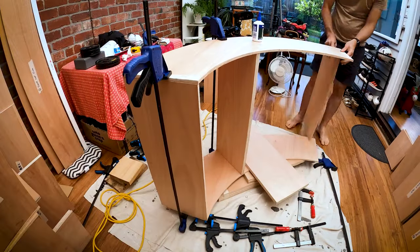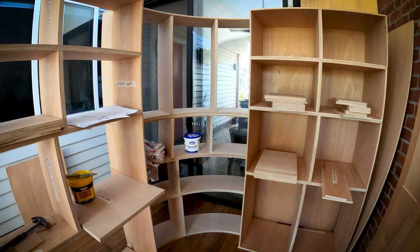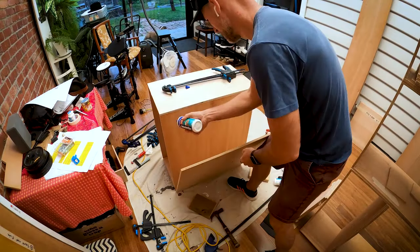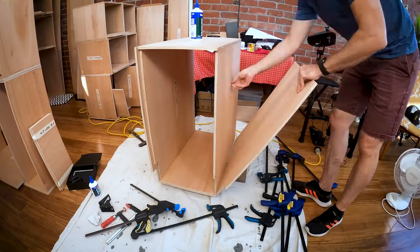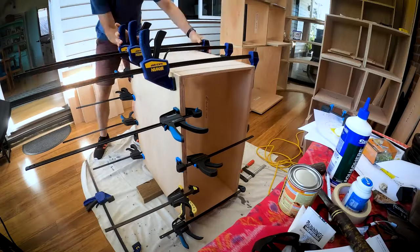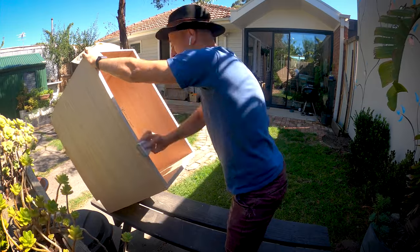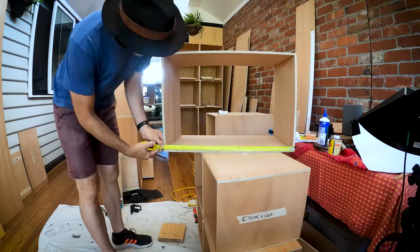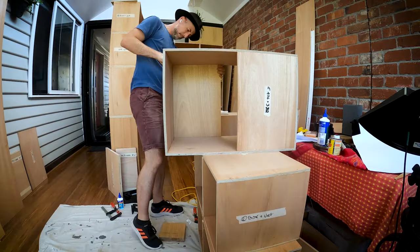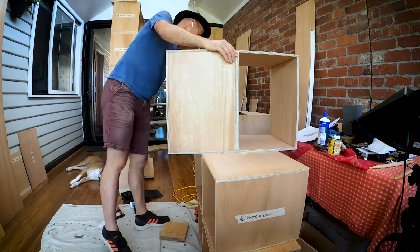With the newly and correctly cut vertical panels I was able to reassemble the bottom curved shelf. This is not the final configuration — the big one will actually be on the bottom, I just wanted to see how it looked in place. Next was the bottom of the return shelf which is slightly different to all the others — it will sit at a 90 degree angle to the ones above and is designed to house an existing set of drawers. Once everything was together this one was actually finished so I gave it a good sand to be ready for staining. Next it was time for the center dividing panels and the box faces or backs. Honestly I was a little bit nervous about this stage because this would reveal how well I'd done in keeping everything square. A little sanding was needed in places but it all seemed to be pretty close so it was time to glue them in.